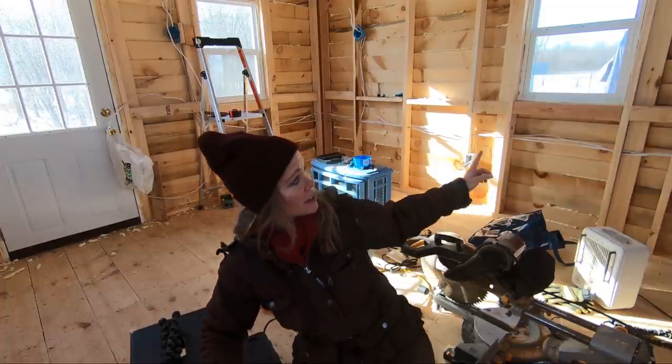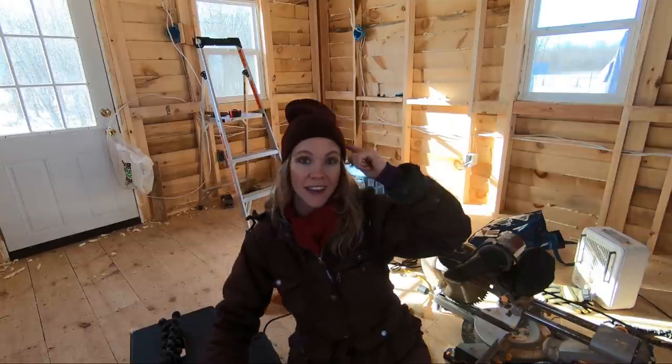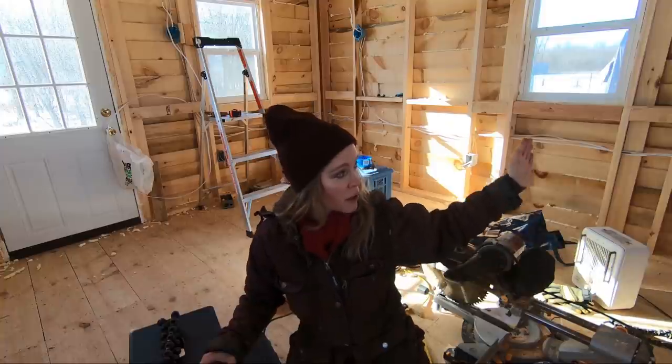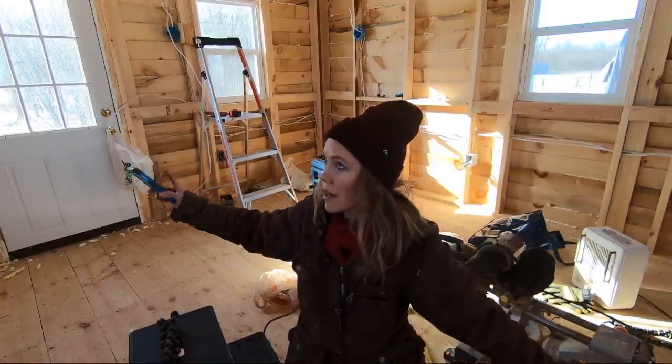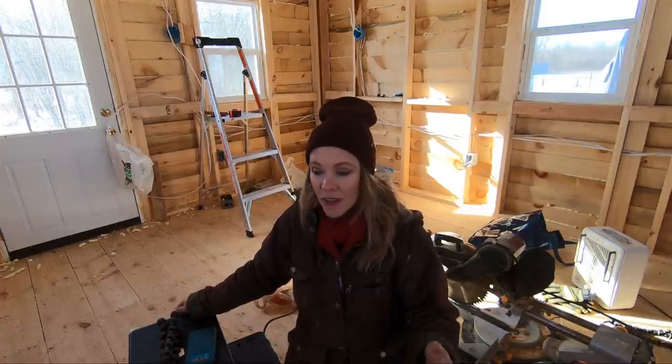It is 13 feet to run it from the center over there up and then over to that light. It is 32 feet to run it from that point all the way around and then up to that light. So that would be the better way to run it.